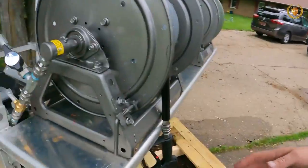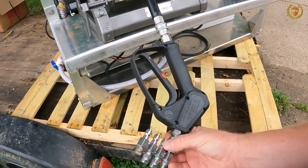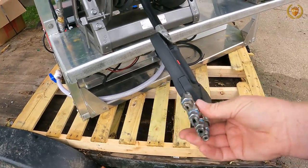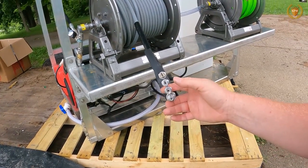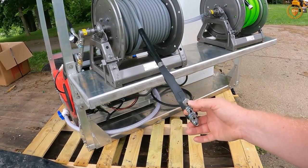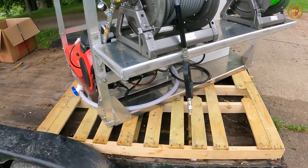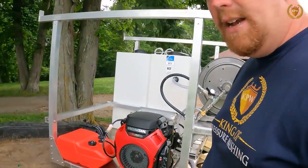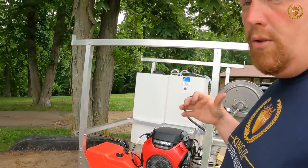We have 150 feet of hose, a Sutner gun, and a J-rod. On the J-rod I have a 0060, an 0560, a 2560, and a 25-15 high pressure nozzle. Those are my favorite J-rod setup. I do not like using a high pressure zero-zero because it screws things up and cuts your flow — and keeping good flow is the whole point.